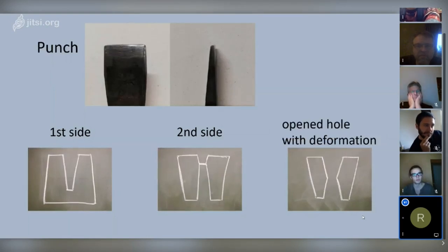This is a punch — it's slightly flat on the working end. I slightly exaggerated the deformation in the first drawing to prove the point. When the two surfaces meet on the second side, you push a small slither very cleanly out. It's best to do this at a slightly lower heat because the material will shear off instead of smear, leaving a very clean hole.